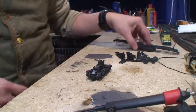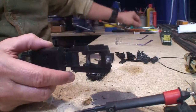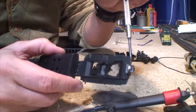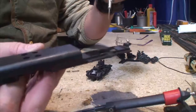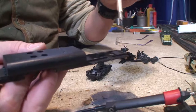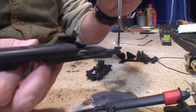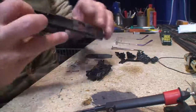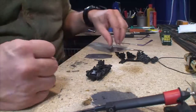So we got our frame here with holes drilled, and now we have some tapped 2-56 screws. Later we will body-mount couplers. Usually these are almost right on — if not, we can use a washer. These screws are tapped so we can screw them in and out to adjust with washers. And we've got our tape in there to isolate the motor.